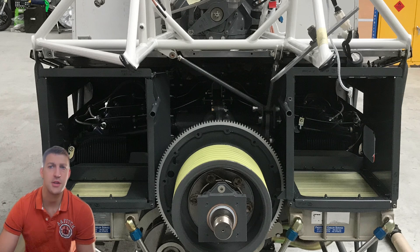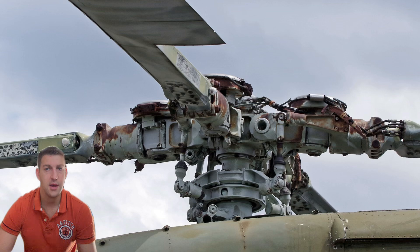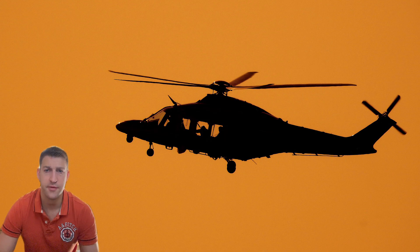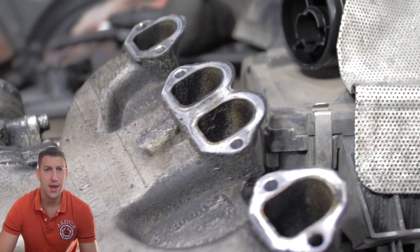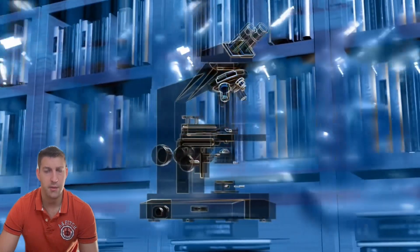This is the basis of the 2,200-hour overhaul of the Robinson R22, R44 and R66 series of helicopters. Common components include main and tail rotor blades, rotor drive shafts and specific engine components. Ignoring life limits set due to fatigue concerns is extremely dangerous and invalidates airworthiness certification, as expired components have a drastically higher risk of failure — even if they appear visually intact, the fatigue cracks are microscopic.